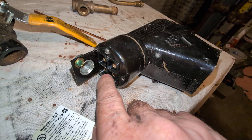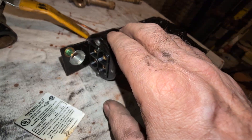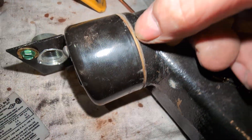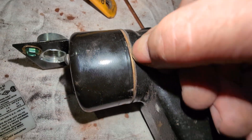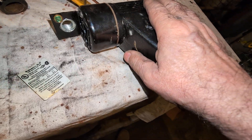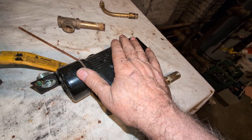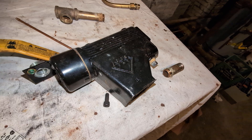You can take out the two dozen screws and pull the float out. You've got to clean the gasket off — you can see there's the gasket where my fingernail is right there. So you want to make sure you have a gasket and probably an extra float if you want to try to rebuild these. But I wouldn't try to rebuild these. I would replace these or substitute an electronic control and get rid of this float if you possibly can.